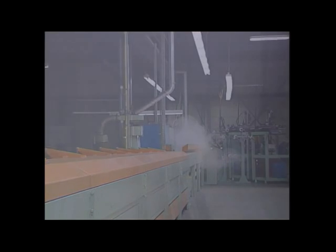There follows the drying and curing track for the adhesive. The cooling track at the end of the line cools down the profiles, as hot profiles are sensitive to pressure and therefore cannot be wound up.